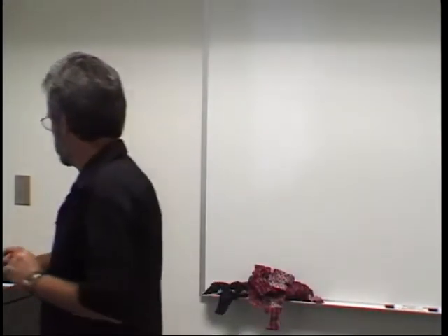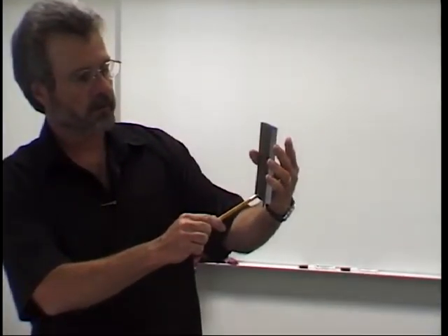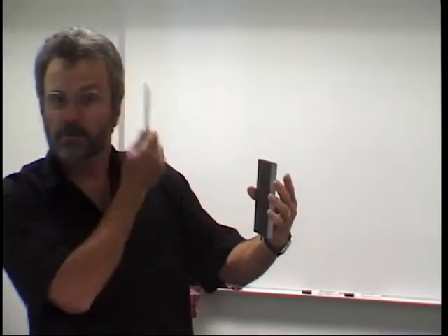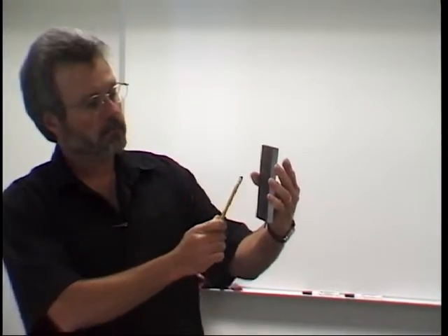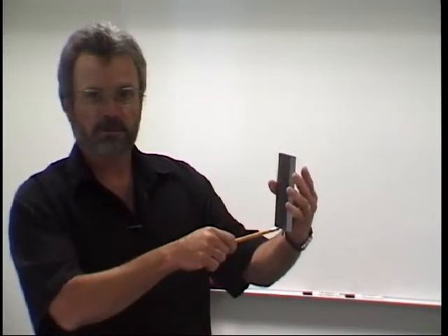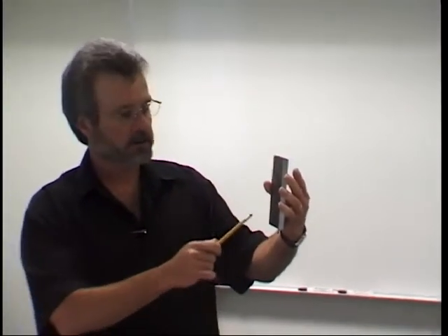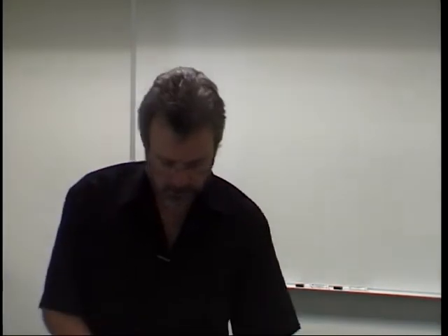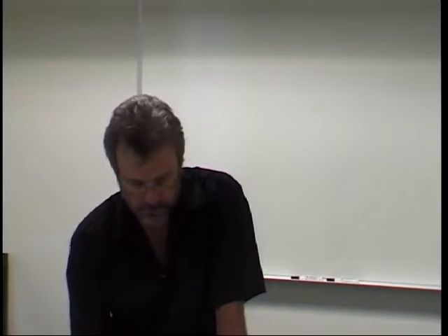What they want you to do is just take a piece of flat steel and you're going to strike an arc at the bottom and go in a vertical up progression. If you remember from one of our previous talks, I mentioned that if you have a material in a vertical position, you have to specify whether it's vertical up or vertical down. Everything you've done so far is going to be vertical up. Here's what I want you to highlight and put a bullet by because there will be a question on this for your test.